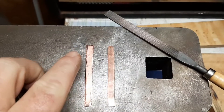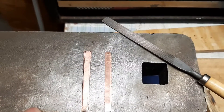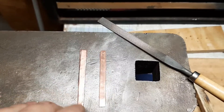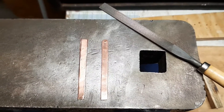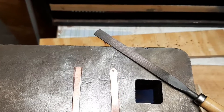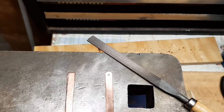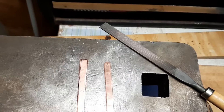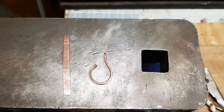I have to file down to that line to make it equal. Then I will round off this end, keeping one end flat so when I curl it up it'll be flush. I'll also drill the hole in it — figured I'd do that so I'd know it was right where I needed it, because there'd be no need to work on the second one if I screwed the first one up. So I've got one bent.